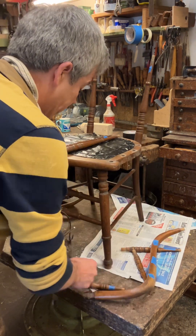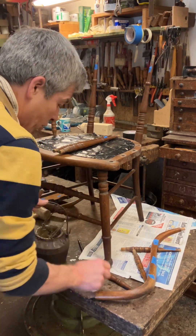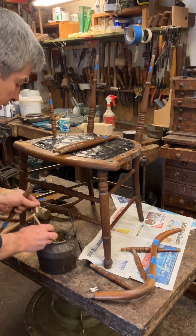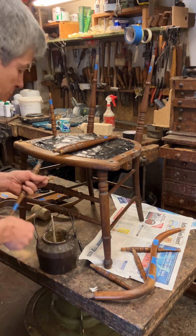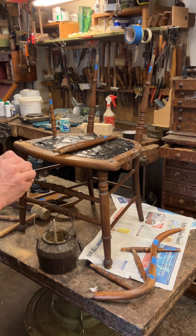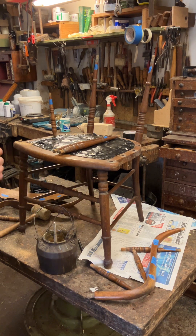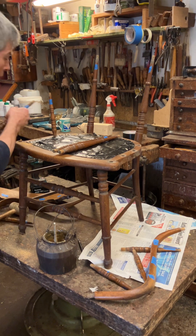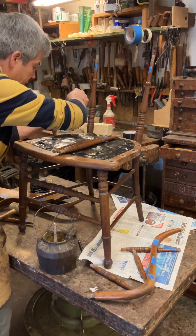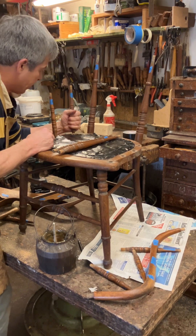What I've got to do now is use my animal glue - it's an old technique. I'll just put a little bit of glue on the dowel and push that into the spindle. The most important thing is it's not too long to go in there, so when you glue the chair up it doesn't stop the chair gluing. Just tap it in. Put it up to the chair so you can see - you can see that's not going in properly... actually, it's perfect.